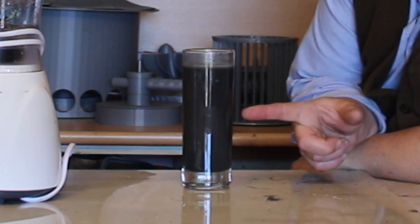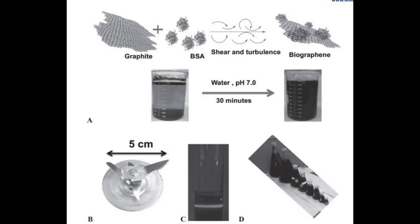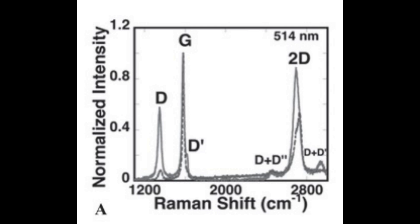I've scraped off some of the foam and there it is — it's a kind of blue-black colour. Apparently it's stable in suspension for about two months. If you want to separate it out, you need to centrifuge it at 45 minutes at 1500 rpm. The proteins, which now coat the graphene, prevent it from re-stacking, so you'll get a dry powder that way. If you're going to use this, I wouldn't bother — it's already really nicely dispersed. Just chuck that in some sand and cement and you're going to have yourself graphene-improved concrete. To prove that it's graphene, you really need a Raman for that — you're looking for the G and D bands. I'm going by what the paper said; the paper said it's graphene and I have no reason to disbelieve them.